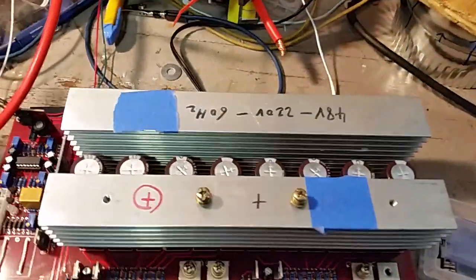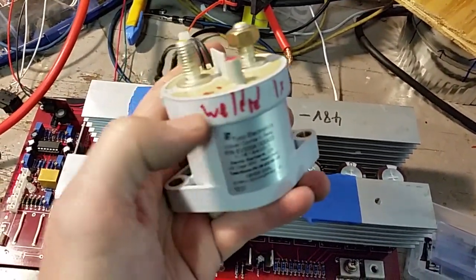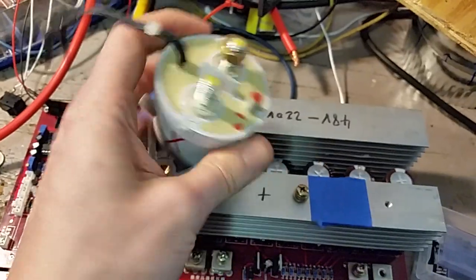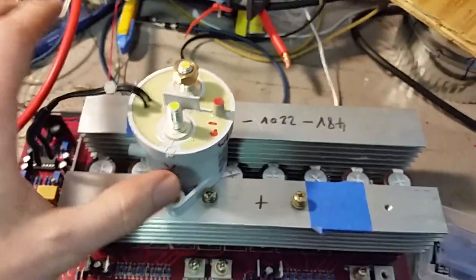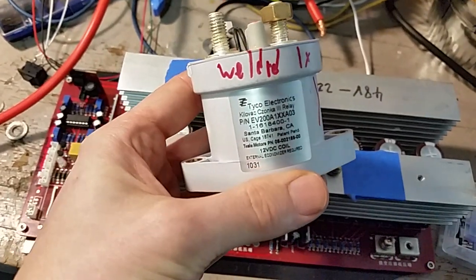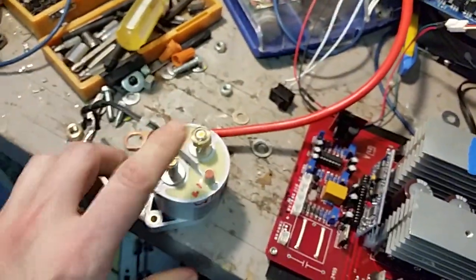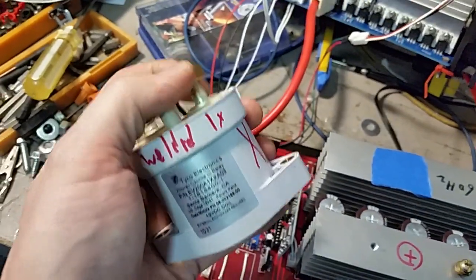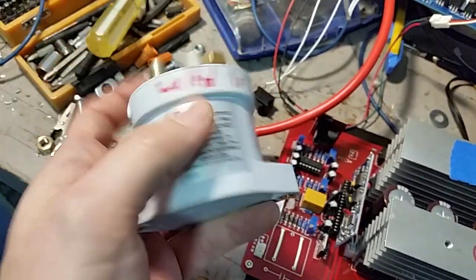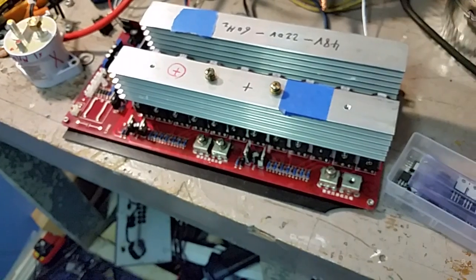I'm going to wrap it up — stay tuned, I'm not done making videos. My next video I'm going to find out what's inside this contactor. During one of my many incidents with these things blowing up, this thing welded shut — meaning it's supposed to open when you de-energize it and break the circuit, like an automatic switch. It's not supposed to weld shut. I'm well below the rated voltage, and it can do 500 amps. It's not welded now — just give it a tap and the contacts open up again, so it still functions and it's good for testing. But if I'm ever going to hook this up to a house, I have to have something I trust, so I won't use this damaged unit. For fun, I'm going to cut it open on video and see what it looks like. Thanks for watching, take it easy, play safe.